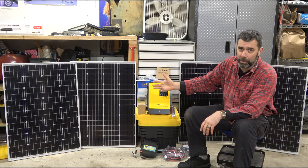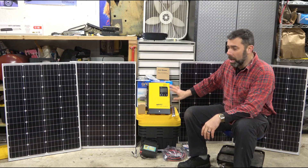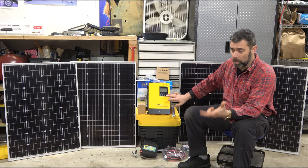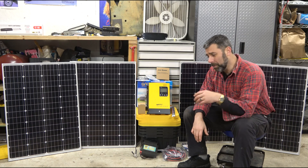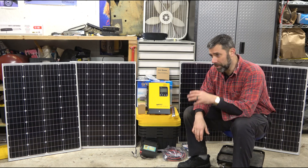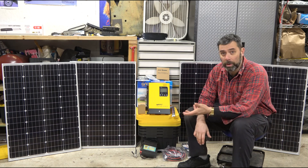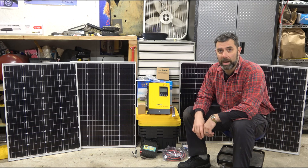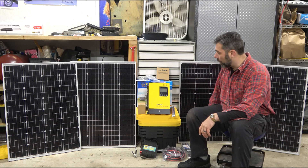The panels are obviously reusable, but the solar charge controller — oftentimes the kits you buy at 200 or 400 watts will come with a charge controller that's only capable of handling the voltage and amperage that kit provides. So if you want to go from a 400 watt kit to 800 or much higher wattage, you're left with a bunch of equipment that's no longer any good.